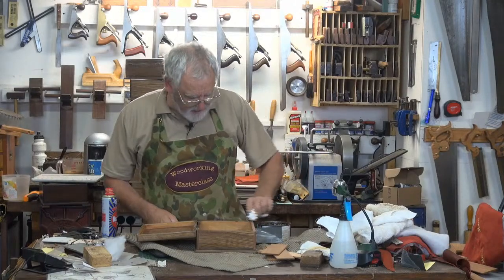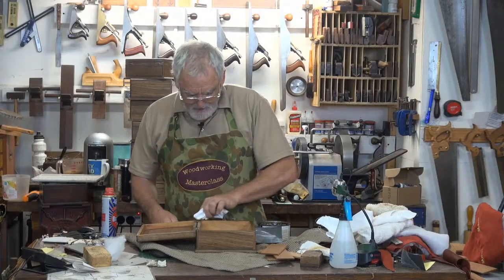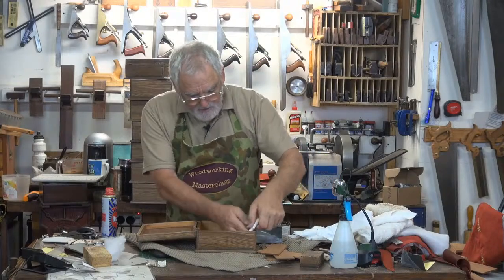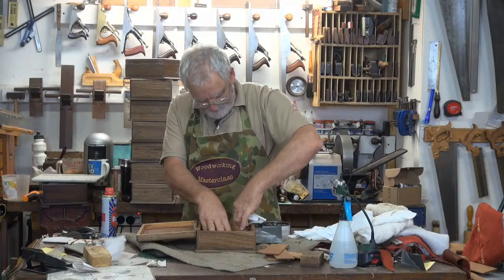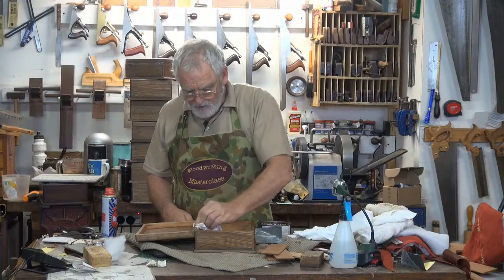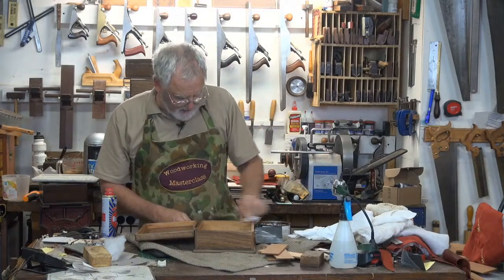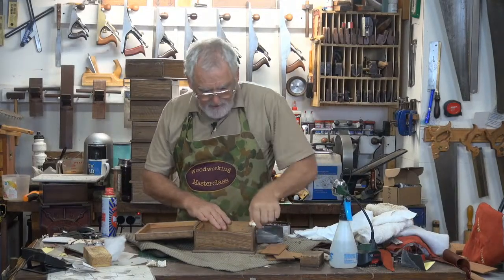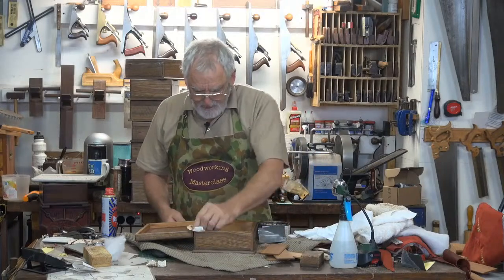Number one thing to check, or two things equally important. One is what angle do you have your blade sharpened at? But I'm starting to suspect more than anything else, the back of the blade isn't dead flat. I would say you had a turnover or something right on the cutting edge on the back of the blade. On a soft bit of softwood, it doesn't make that much difference. But when you're using something with a bit of density about it, it does.